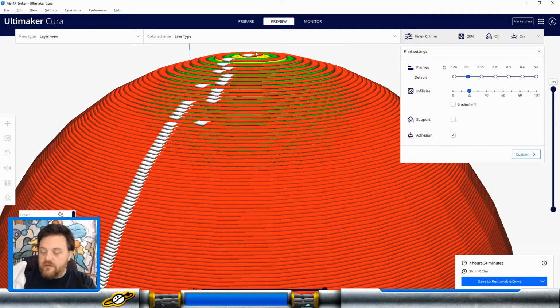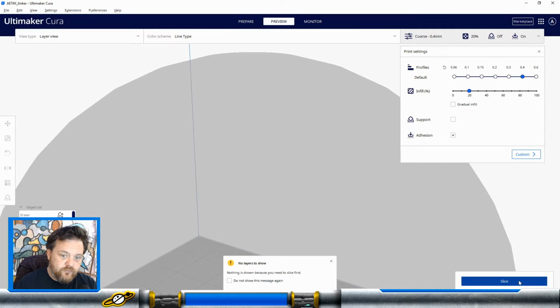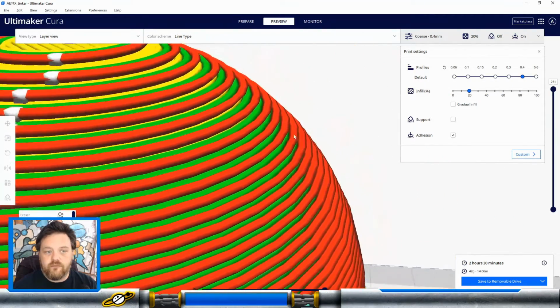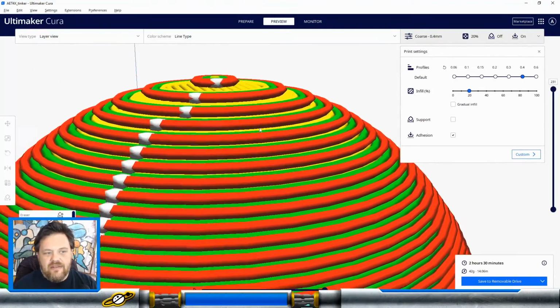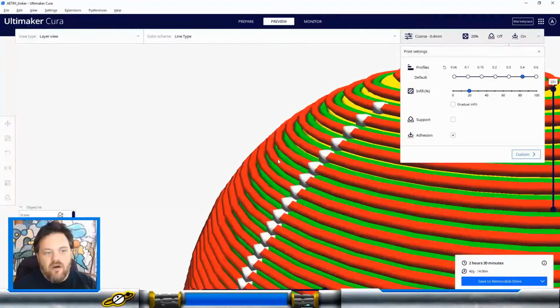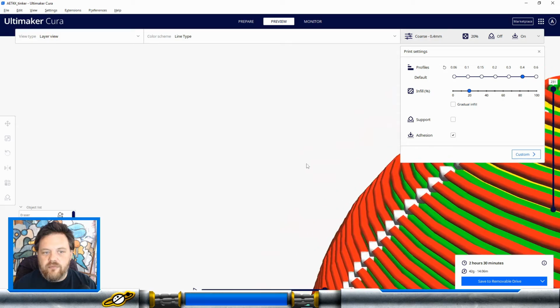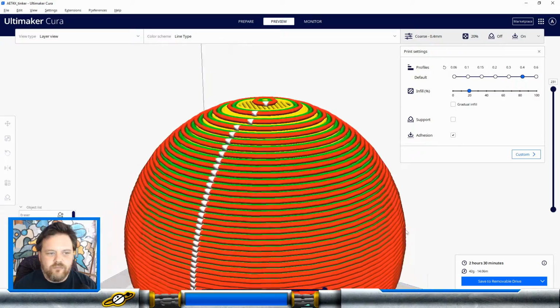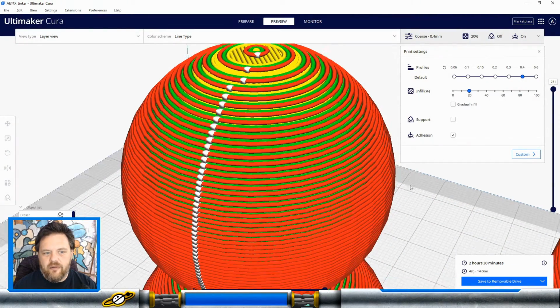But when you look at this to this, you can see all those layers of lines. So keep that in mind, because when you do large fills, that might be slightly more visible. As you can see, as this thing curves up the edge, you see all of that second wall as it tries to stagger all of that through. So this would be a much chunkier print at 0.4. You would see a whole big flat part right here.